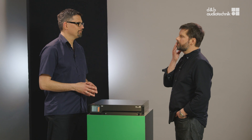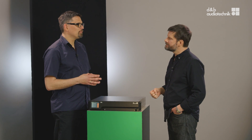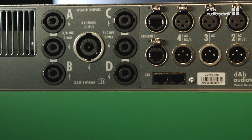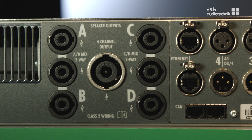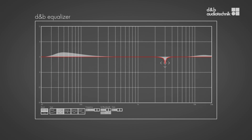It sounds really interesting, from the outside controls to the power inside, what else is in there? The D20 amplifier has four independent 1600W channels, each equipped with D&B loudspeaker-specific setups meticulously developed by D&B. This setup includes the voicing, or sonic footprint, of each D&B loudspeaker, specific limiter settings and dedicated user-definable configuration controls to adjust the system. And on top of that, two powerful banks of equalizers per channel, plus delay for the user to optimize a system on site.